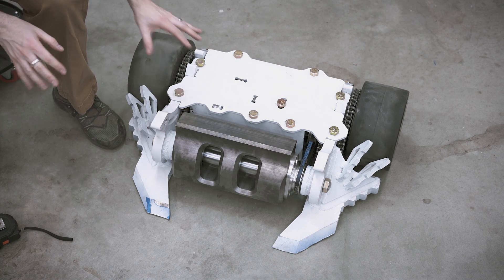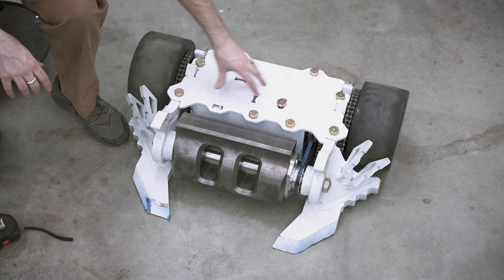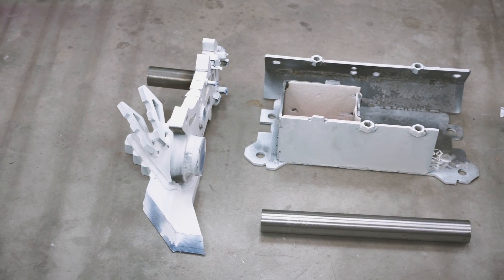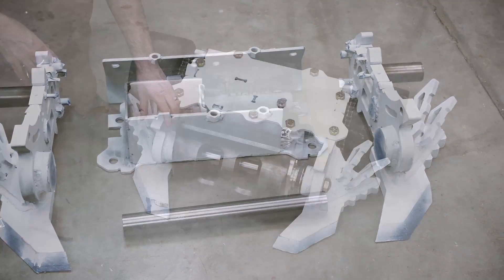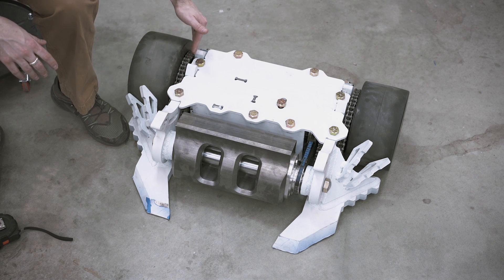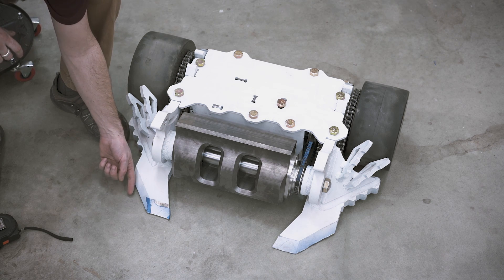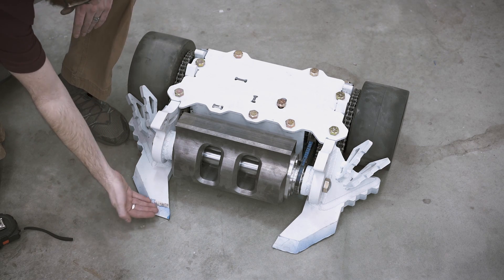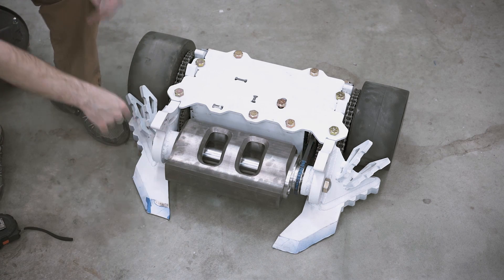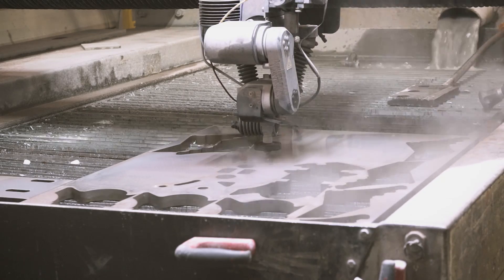Let's talk about the frame and main structure. The main structure is really comprised of the left side, the right side, and then a top cover and center pan inside. The left and right sides hold the drive systems, and the weapon fits in with a bar in the middle. The left and right sides are made out of AR450 — basically hard-ox steel — with one inch thick slabs on each side. The forks down below are also one inch, and they're cut at a 45-degree bevel on the sides and front, designed to scoop opponents up into the drum. These parts were all water jet cut with our lovely sponsor, Rocky Mountain Water Jet.